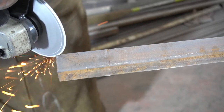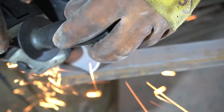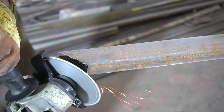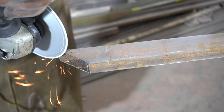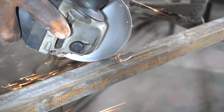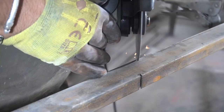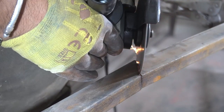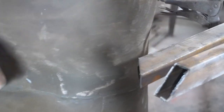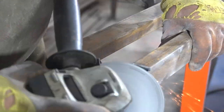The major advantage of this blade is that it's not going to shatter very easily compared to regular cutoff wheels, and you can use the cutting edge of the blade for deburring purposes also. And being made out of metal, the blade did not flex at all and gives you straight cuts, but the cuts are not very clean. Since it's a diamond blade made out of metal, it's not going to lose diameter and always maintains the same 5 inch diameter, compared to the regular cutoff wheel, which usually reduces in circumference with every cut it makes. But there are disadvantages too.